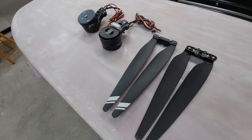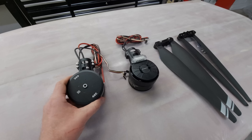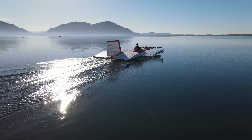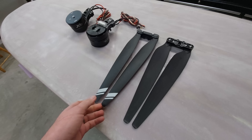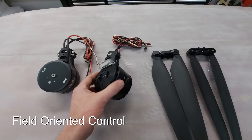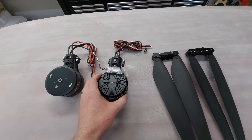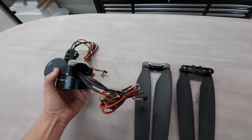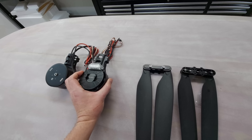I'm going to try out two giant drone motors instead of a water motor. These are the Hobbywing X8s — the same motor that Daniel and I were using on that giant RC Ekranoplan — and these are 30 inch props. These have built-in speed controls; they are FOC speed controls, so they're quite a bit more efficient than regular brushless motor speed controllers. You can mount them on approximately a 30 millimeter tube, so we'll have two of those.